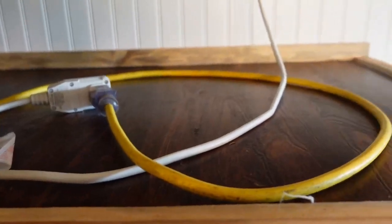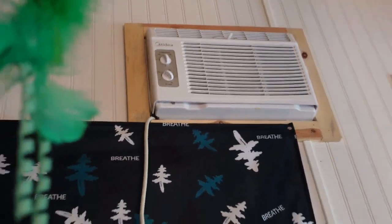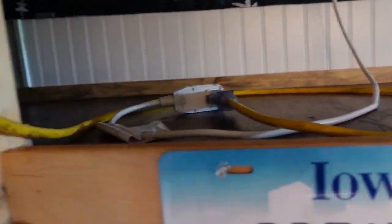Right now I'm testing it to see how much battery and how many solar panels I actually need to run this whole place. I've set up a little shelf near the door with the inverter and the big battery. The biggest power draw in the tiny house is the air conditioner, so I have an extension cord running from the inverter to the AC unit, which is running fully off solar.